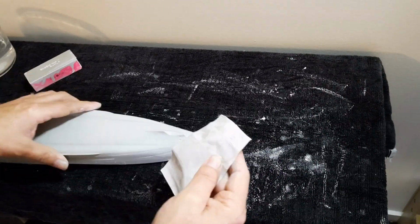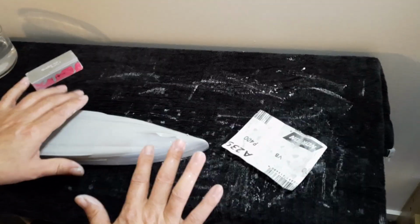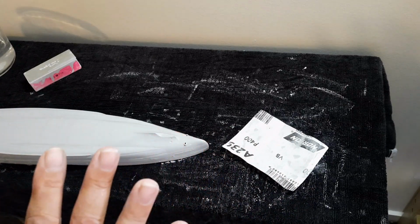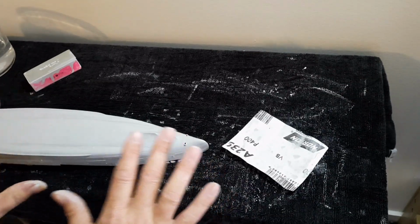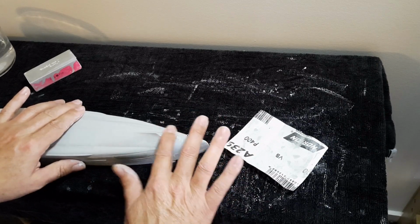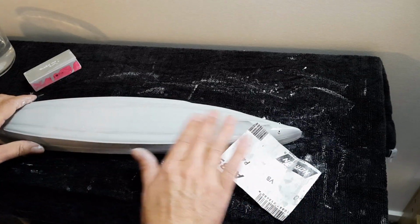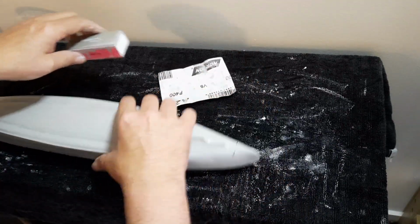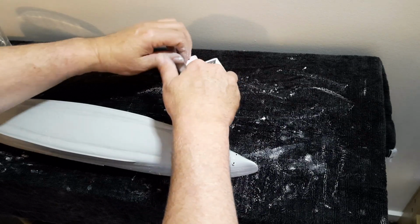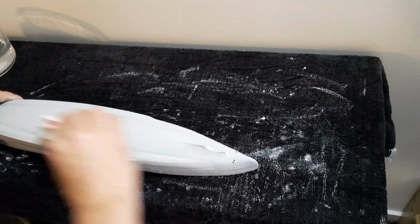I'm not a big fan of using sandpaper without a block because you can leave groove marks just from having your finger there. So really try to avoid just using your fingers. Parts where there are corners, it's fantastic. But smooth, straight stuff, no. Just stick with the block. Put your block in there. Put it that way. Set it up, and just continue on.